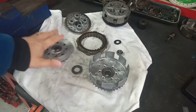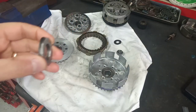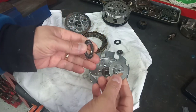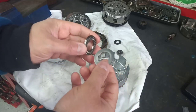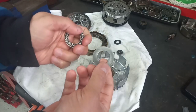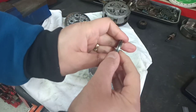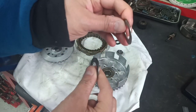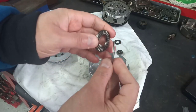We've talked about the bonded shim, so the next thing to talk about is the bearing. I did waver a little bit on this job. I thought, is it the right thing to do, making a new thrust plate? Should I just add an extra shim? But I don't want extraneous parts, really, if I can help it. So I made the thrust plate. We've added a millimeter. I don't know if you can see that very well, but you can see the thickness. There's the original. So we've added a millimeter, and that gives us our deck height in there.